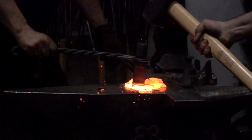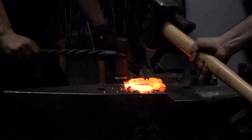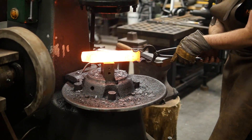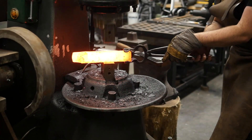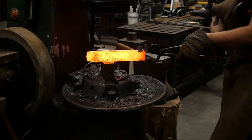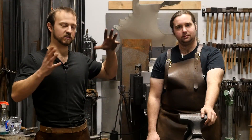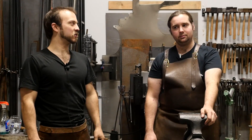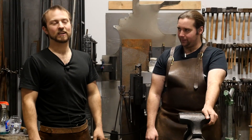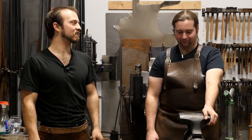That's why the hydraulic press and the rolling mill and tools like that have become the mainstay of most pattern welding, simply because there isn't that spray that goes everywhere. With the hammer, you know, to lubricate the ram, oil comes down all the time with a puff of smoke. We were just talking about breathing in toxic dusts, so avoiding burning oil and flaming molten slag is good.